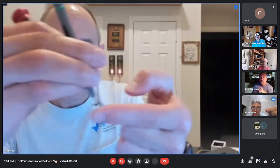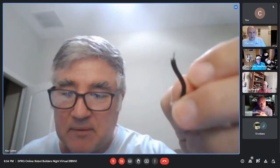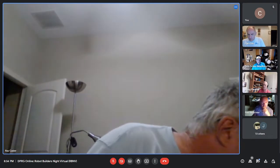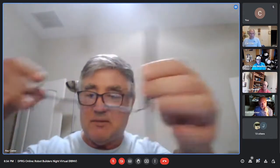This is kind of the same thing. It's a socket on one end and a pin on the other. I've got it in front of my camera. There you go. It is the same distance as the probe head. So basically, you don't have this long ground lead on it. Those two are about the same length, and that works really well.